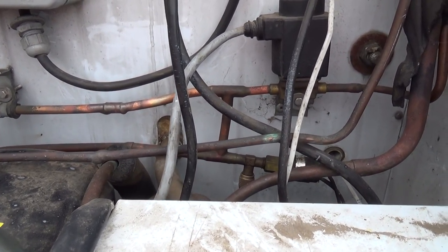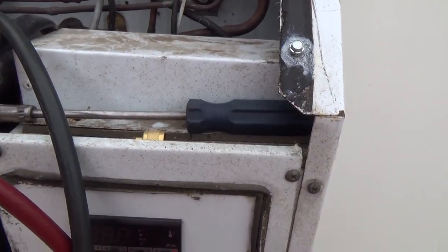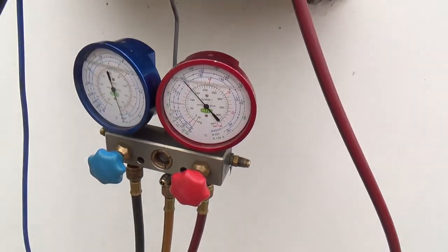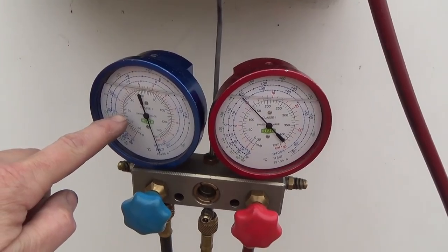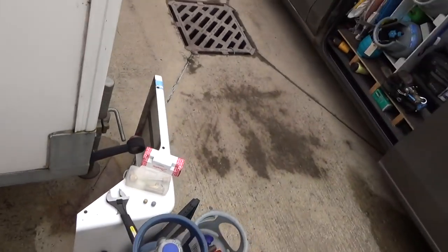Put gas in it and then found it's running at minus 30 and the room was at plus 10, 12, something like that — 40 degrees difference. So it's running at just over one bar, about 20 psi on R404A, so I decided the capillary is restricted.